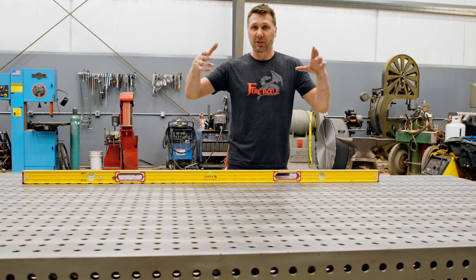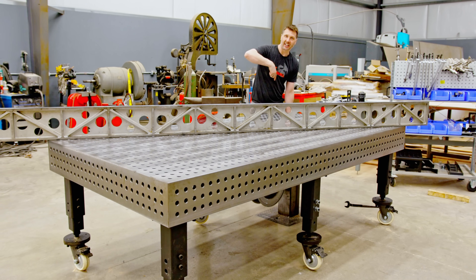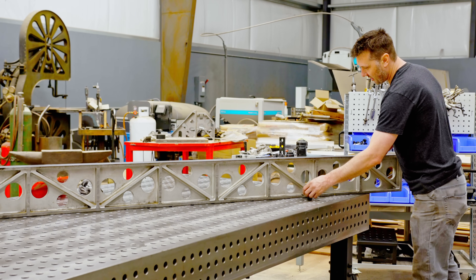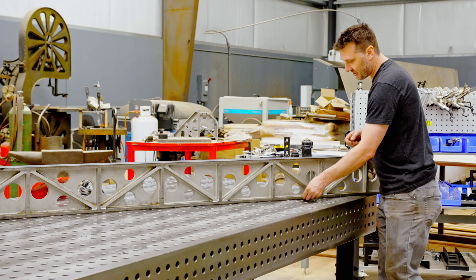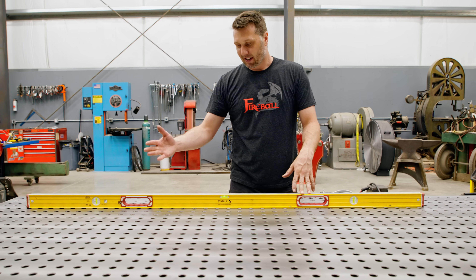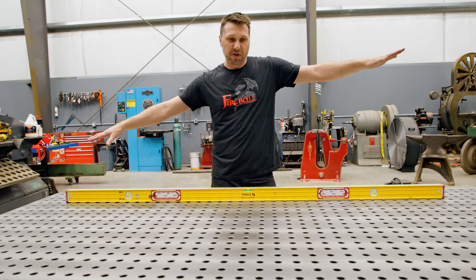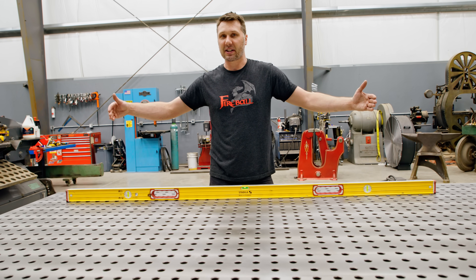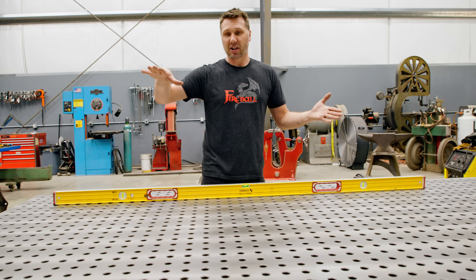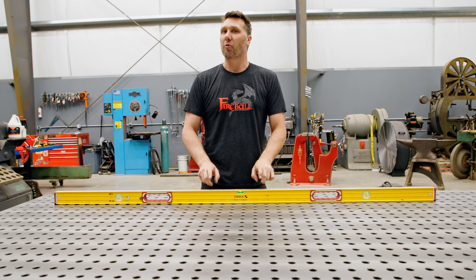So how do we get the table to come back and spring flat? One way I like to do it is use a gigantic straight edge — by far the fastest and most accurate way to get the table twist out. The other way is to use a level, which is your cheapest option. This level is just a couple hundred dollars and we're going to use the earth's horizon as our gauge. With the straight edge I'm using it as the gauge and don't need to be level, but in this application the table will actually be level when we're done.